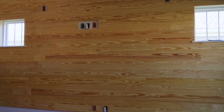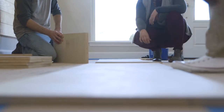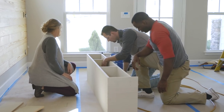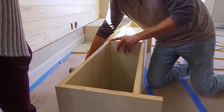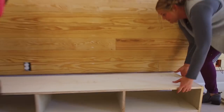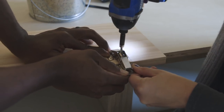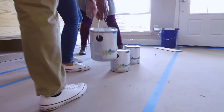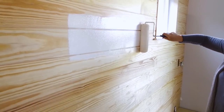Now we're going to move on to phase two of this project and add some functionality. My storage solution is to build low profile cubbies the length of the wall. To do this we're taking one inch cuts of plywood and nailing them together to create a rectangle, then dividing that rectangle into smaller sections. These cubbies will have plenty of storage at 10 inches high and two feet deep. To create some hidden storage I'm adding six doors made with the same plywood and attaching them with simple hinges. The last step for our planked wall is to add a coat of white paint, which will give the planking and storage cubbies one cohesive built-in look.